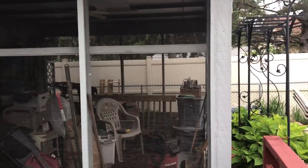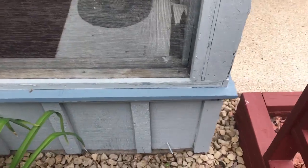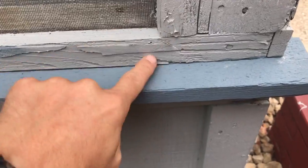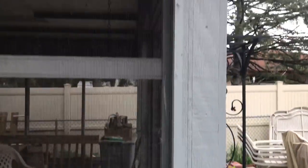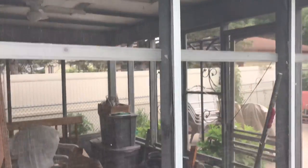So we're not breaking pieces to add cost or have a customer get mad at us for wrecking something that's there. Typically with things like these, where we're trying to take this part out, we have to take this part out of here when this piece doesn't even really matter because of the screen is there. So the top, this board up here, anything wider of a board always has issues with taking that off, because wider cedar boards get these cracks in them. So if I take this board off just all willy-nilly and just pull it off, it's probably going to break that piece. So I've got to very carefully go through like a surgeon and take all these pieces of wood off, so we're not breaking them. If they do get broken, it's all of the wood's fault, not our fault. We're doing our due diligence not to break them, but sometimes you just can't do it.